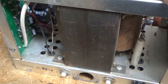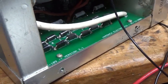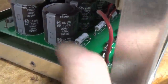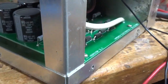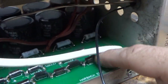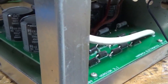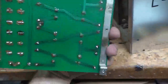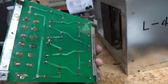Just noticed the guy who put the Harbach board in — someone who works on a lot of Drake stuff — didn't put the fish paper back behind the board. It's literally a sloppy soldering job: globs of solder. I don't know how far back the wires are protruding from the board. I'm going to have to lift that up, fix some solder joints — it's really bad. So I'll also replace those wires. The front and rear all look good, but there's no fish paper — it's supposed to go between the factory brackets and the board. I'll install that and put it back in.